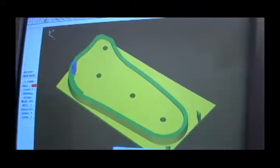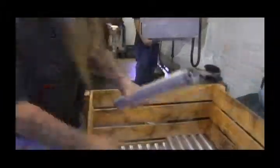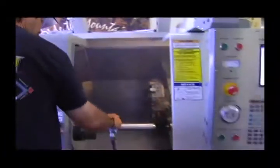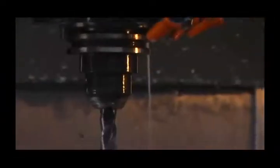This shop supports the frame shop and the warehouse on all kinds of parts. In our machine shop, we manufacture the primary, the lower legs, the fork controls, and other various parts. We start off with a billet aluminum — one solid round piece. It gets a gun drilling process, which uses a huge tool that drills the center to very high accuracy for the bushings and for the operation of the hydraulic lower legs. It then goes through milling and lathe operations to put in bolt holes for axles and all kinds of stuff. What you're witnessing right now is a cylinder for the rear brake being machined.